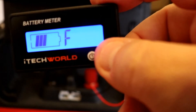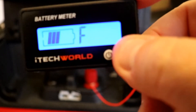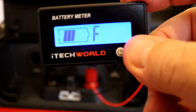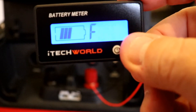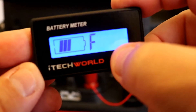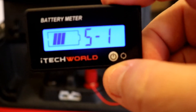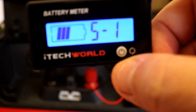Press on the front one, which will give you how many cells. I recommend if you have a look through the instructions — for the AGM you can set through either 12 or 24 volt. But see it scrolls down to three — you can press the button on the back and that will give you four. So for any of the lithium batteries that are 12 volt, certainly with the iTech ones, you set it into four there.